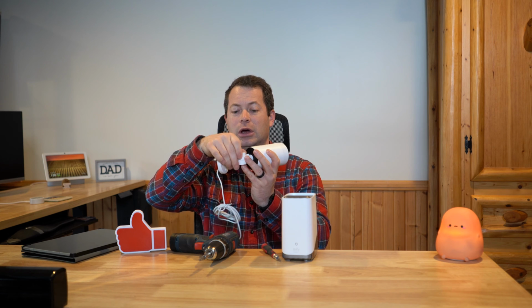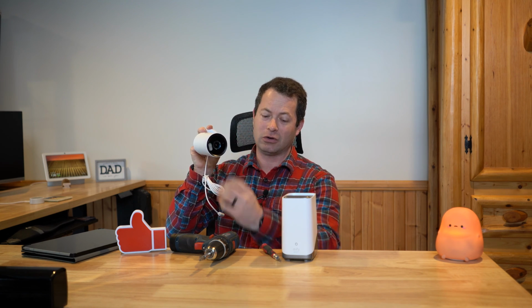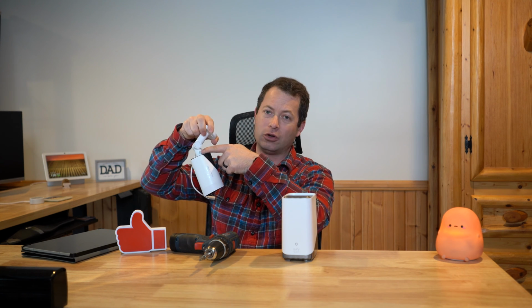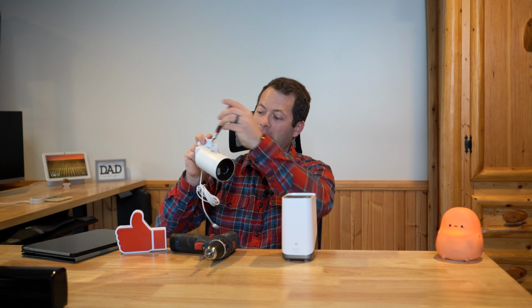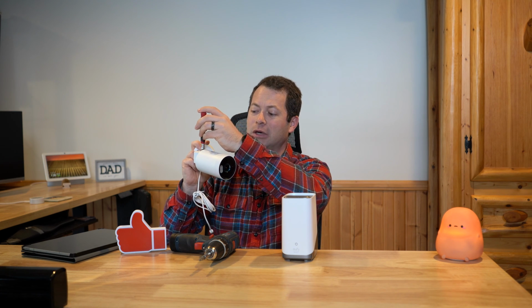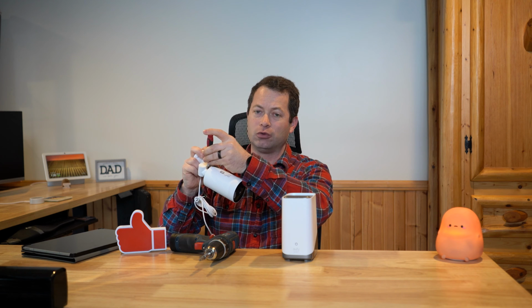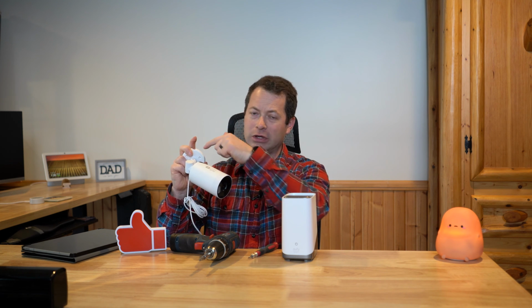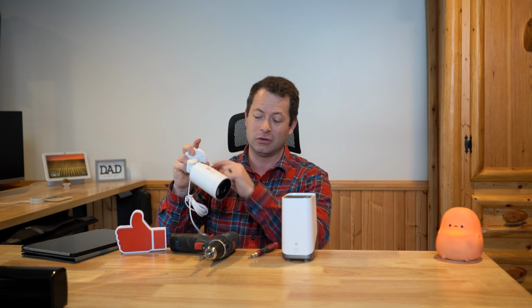And now, of course, if you did that and you attached it, your camera would be sideways. So now you need to get your camera to be rotated. So to do that, you loosen the one that's closer to the camera, not the one on the base. The base one actually appears to be keyed where it doesn't let you rotate it, but you can loosen this one up just slightly. And you do have to remember there is a cord that runs in through here, so you don't want to take this and just rotate it around and around, because you actually twist the cord that's inside there.